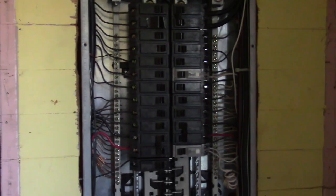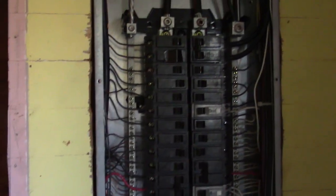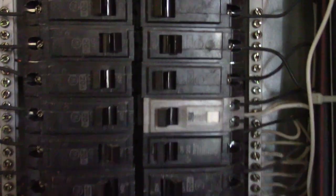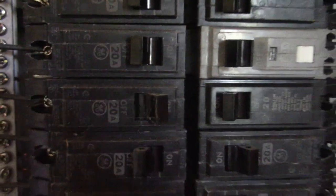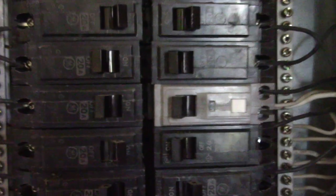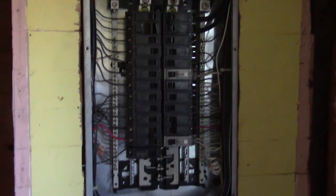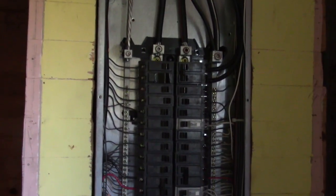We're not going to use the dishwasher in the remodel, so I'm going to repurpose that circuit for our pantry lights. I need to make sure this breaker stays off. Like on number three here, I put a piece of tape over it so it doesn't accidentally get switched back on. Get some tape and tape that switch in the off position. Be safe — don't do anything you're not sure about; call an electrician if you really aren't sure.